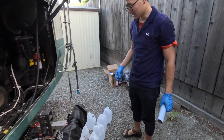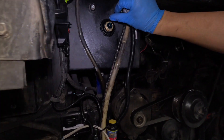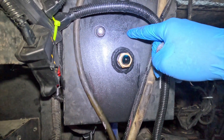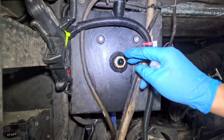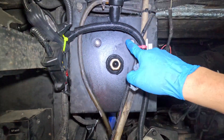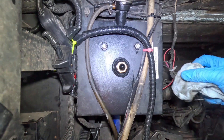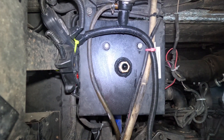I have filled up the coolant — I totally used 9 gallons. We have it above the minimum window mark. When I start the vehicle it will drop a little bit, so I may need to add a little more. One last thing after filling the coolant is to add some DCA additive, which will take up some space as well.